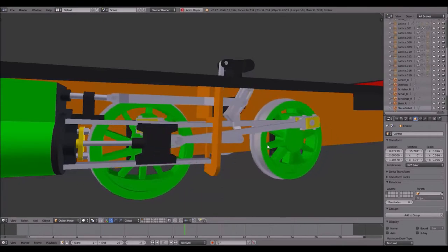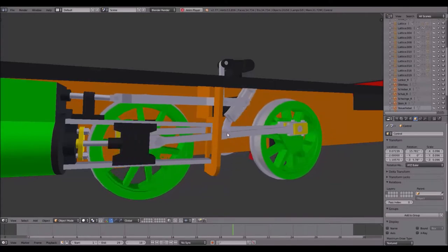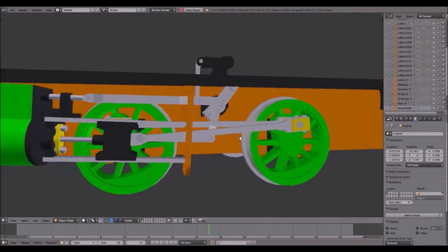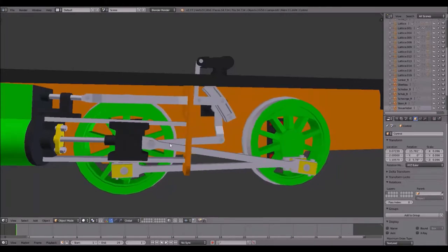The Bagnall Valve Gear is pretty similar in the basic principle to the Walschaerts Valve Gear because you have two different motions combined to move the valves. First of all you have the crosshead over here, and over here is the link. This arrangement over here seems familiar — it's basically the same arrangement as Walschaerts because this is a combination lever. Usually Walschaerts Valve Gear goes to the left or towards the cylinder and upwards to the valve rod, but here it's moving away from the cylinder and to the link.